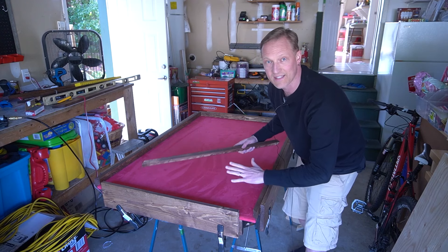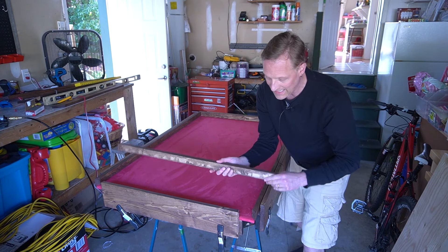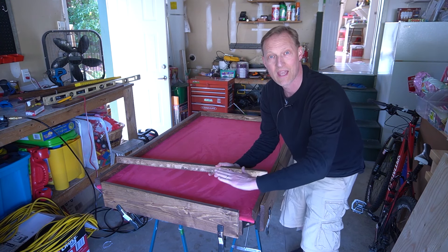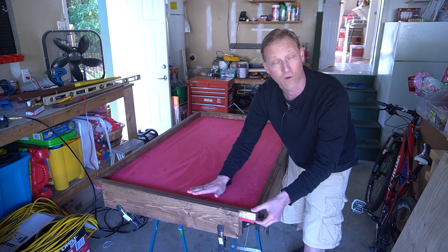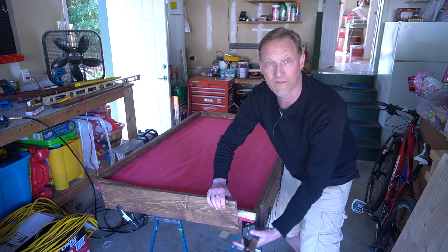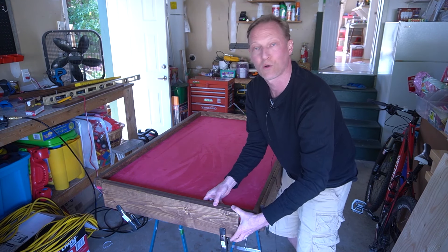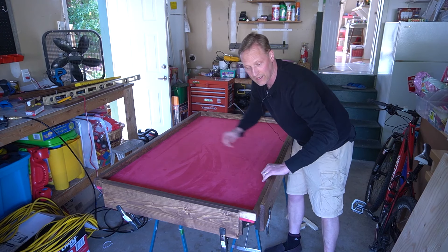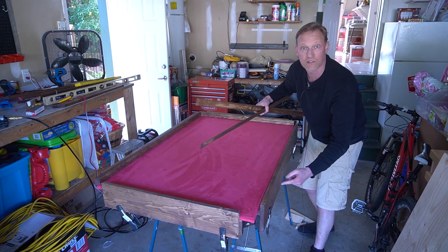Now that everything's stained, I've sat the board inside on top of the frame. What I need is for the inside trim and outside trim to be perfectly flush, because I'm going to put a piece on top that caps it off and they have to be perfectly level. I first put the inside trim on top of the mat for height, then I took my 1x6s and found where the top of that is and clamped it right to the frame to hold it in place. I'll make sure all of these are completely flush and level, then I'll take the frame out and staple these right to the frame.